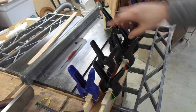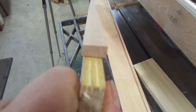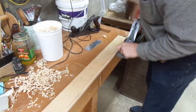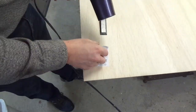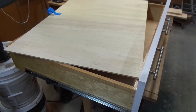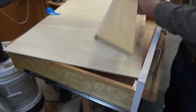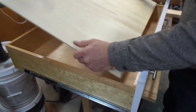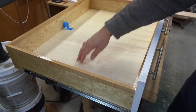This is all glued up — I used the rubber band on the spring clamp trick. I have a fair amount of material to remove from either side of both pieces of plywood so I have this set up on my table saw. Here is the drawer: I trimmed these two pieces, one fits the short way and one the long way, and this piece of plywood is nice and snug in the drawer bottom.